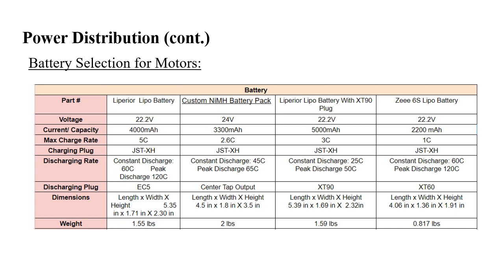A trade table analysis was performed to determine optimal batteries for the motors. Based on the manufacturer's manual, each motor should be powered by 24–75 V DC with 1–4 A current and a 10 A maximum. The trade table analyzed battery voltage, current capacity, max charging rate, charging plug, discharging rate, discharging plug, dimensions, and weight. Based on the required 44–48 V, the team decided on two 22.2 V, 2200 mAh batteries placed in series, producing approximately 44.4 V at 2.2 Ah — appropriate for the motors.